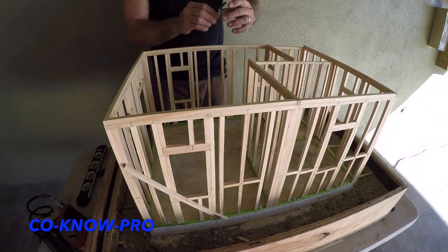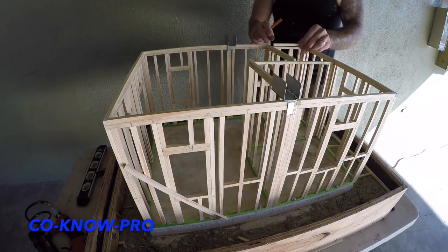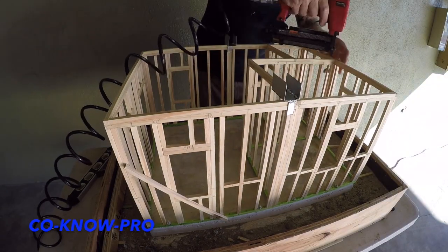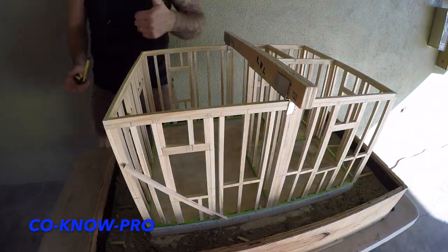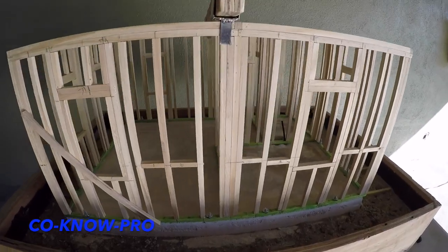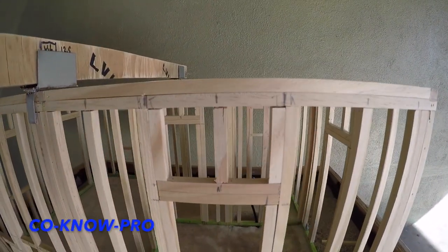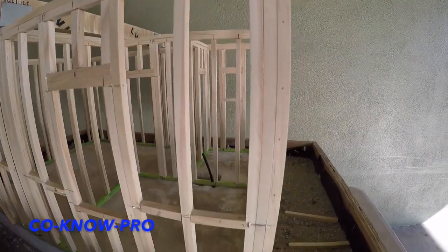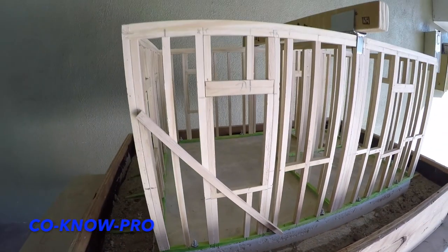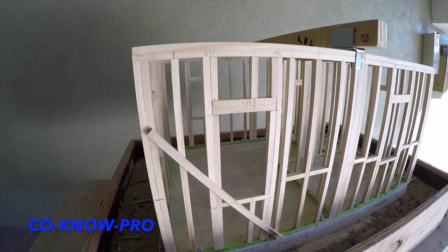We're wrapping up the framing on the walls. We installed our CCQs — those are little fabricated column caps we made to receive the LVL structural beam, which will be covered in the next video. Remember to overlap your top plate with your adjoining walls. The top plate on the very top has to overlap your adjoining walls so that everything locks together really strong. I hope you all enjoyed the video — remember to share with everyone, subscribe and like. KonoPro, peace.